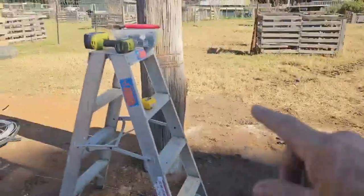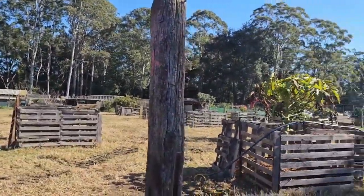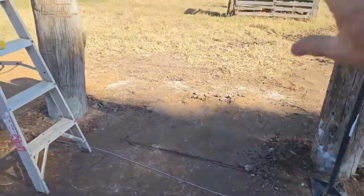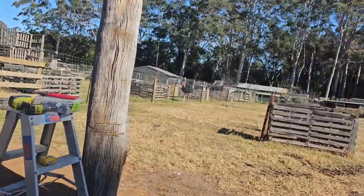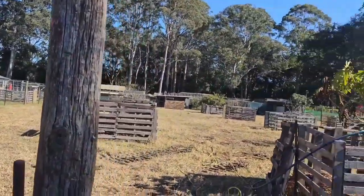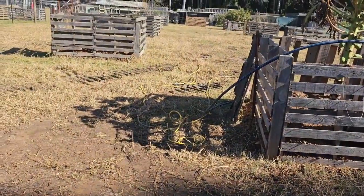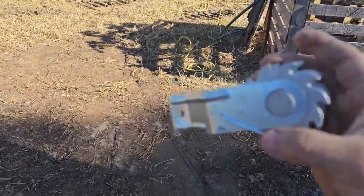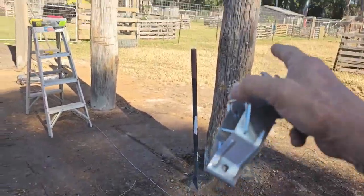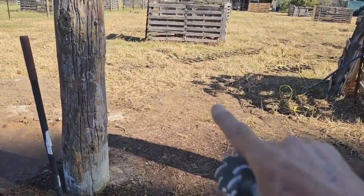Now I've got the wire running along here. This is my main post - I'm going to have timbers going across to the second post. Because there's posts in the way with wire and timbers, I will strain off from the main post. I use these ratchets here - they're really good. In the old days I used a gadget you had to pull like a little winch with barbed wire and it was a pain. These are really good - you can come back and nip them up without a lot of drama. I roll the ratchets trying to keep them in line so it looks neat.